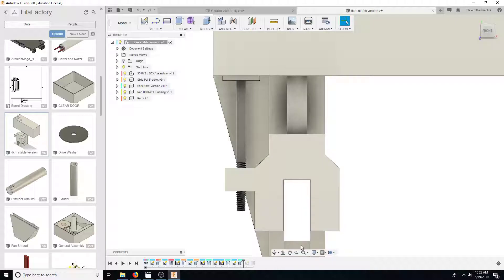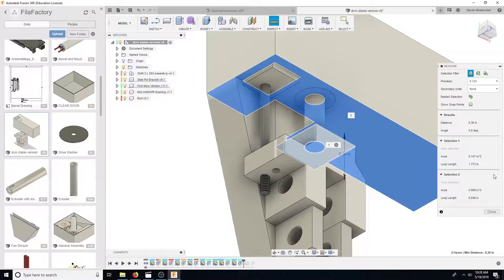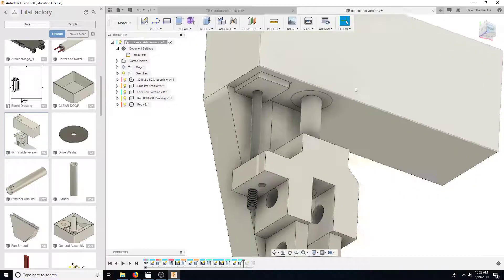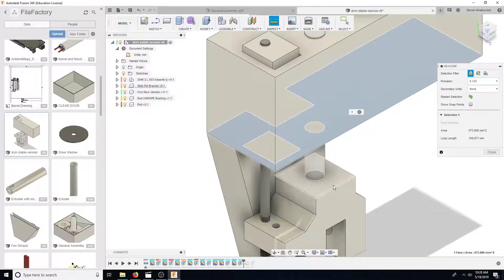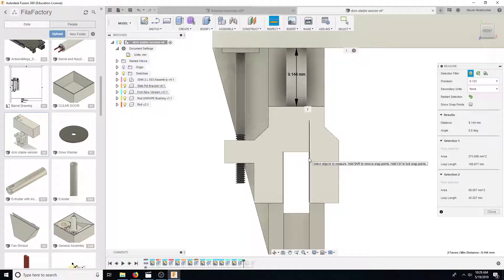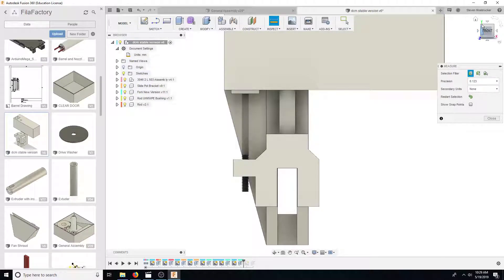It's machined flat so it just rides back and forth. The rod is deep inside here, really close to this bushing, so it won't allow for any movement. This travel here should only be five millimeters — right now it's nine — so I'm going to drop that down to five because this machine is only compatible up to five millimeters. I want very little moment here, because it's so close to this really tight-tolerance bushing that's going to be drilled and then have a reamer sent through it.